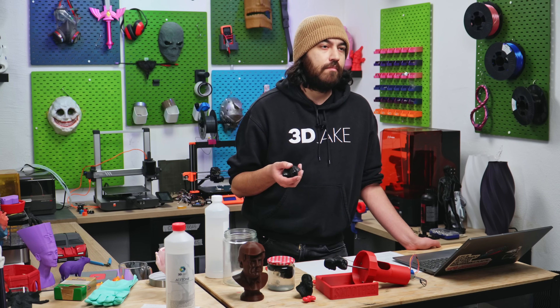I'm not really sure why this isn't done more often. The one we did was kind of over-smoothed — we did a 50/50 ratio and that was a bit too much. Some details were lost compared to the rotation method, although maybe I just prefer them lightly smoothed. I'm trying to get a good ratio for this, but so far one part acetone to two parts IPA seems pretty promising. The other downside is you need to let the solvent evaporate after removing from the bath, and this takes a lot longer than the evaporation method because the solvent has pooled on the surface. You actually need to take the part out of the bath just before it's done because the solvent takes such a long time that it's still doing the smoothing while it's evaporating. But of course you don't need a stepper driver, motor kit, board, or fan to do all this — so there are pros and cons.